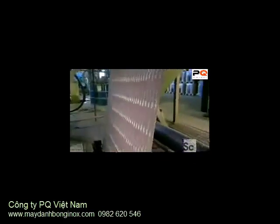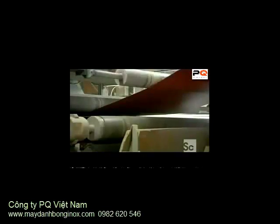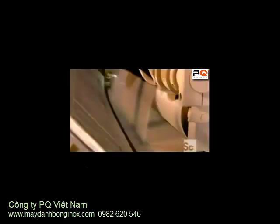Then, the cloth is pulled one floor down to the electrostatic pit. Here, the environment is kept hot and humid, perfect for applying abrasive grains to the cloth electrostatically. The grains are poured onto a conveyor belt in the pit. The conveyor moves the grains under the rolling cloth and between electrodes and ground plates.